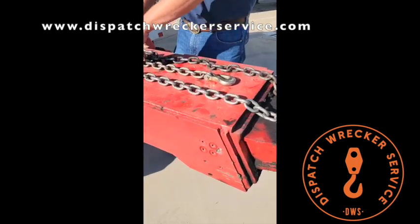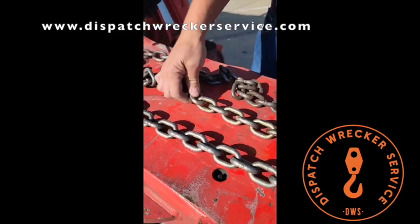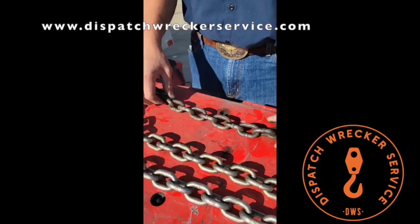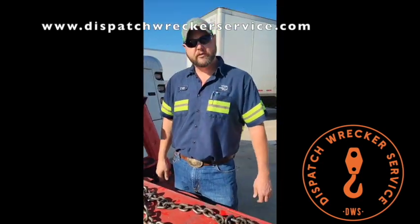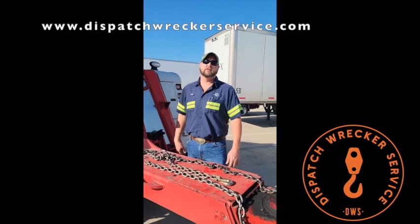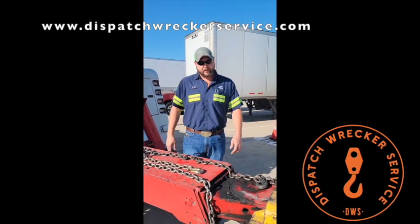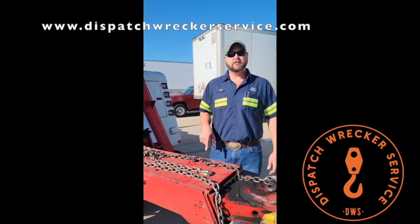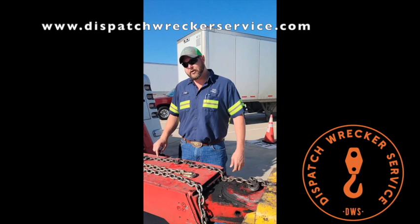Make sure all the links are the exact same shape that they were when you got the chain. And look for these marred places. If you see them, just throw that chain away or put it back in the back of your box. If you ever need to tie up something that you're going to leave that chain on, you might use it for that. But other than that, you don't ever want to take a chance on one of these marred chains, because they'll screw you every time.